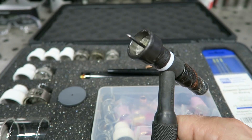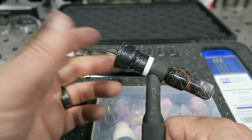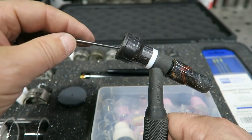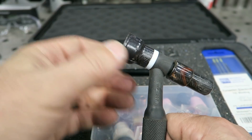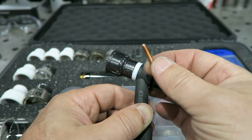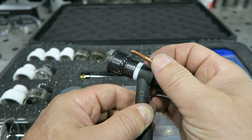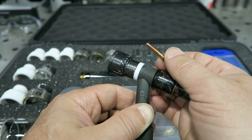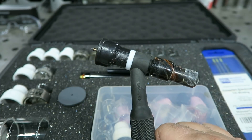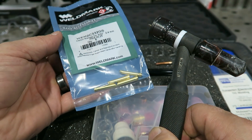Not a big thing, but when you're out here welding for hours on end and you're changing a lot of tungstens, having to sharpen a lot — that little thing can make a large difference as far as just aggravation. I run into a lot where these standard collets kind of give me some trouble. They work great, but when it's time to buy some new collets when they're all wore out and you need some new ones, you might want to just consider these wedge collets.